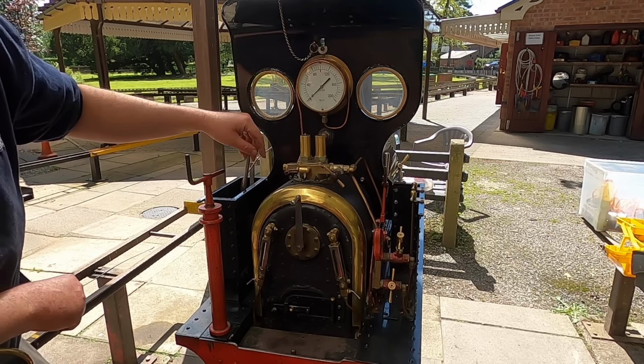these two valves here and here are for water on for the injectors, and these two valves here are the steam for the injectors. This lever is for the drain cocks on the cylinders, and then we have a bypass valve that goes to an axle pump to fill the boiler from the axle pump, which we won't be using, and obviously our firebox door where we will be shoving the fire.